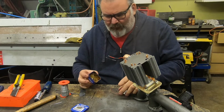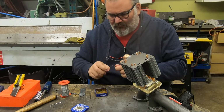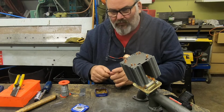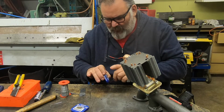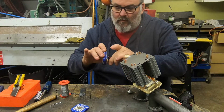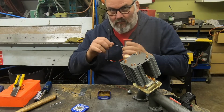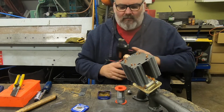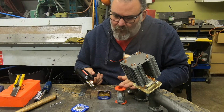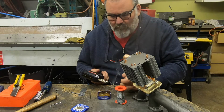First, by dipping your tips in the flux, spin your wires so they're nice and tight. And these are super thin on these motors. The flux helps keep away all the impurities. Solder here, soldering iron, a little bit of overkill, but it'll do the job. Melt a little solder onto your iron. Pre-coat your wires.